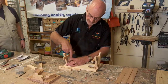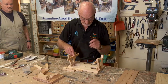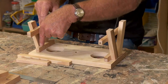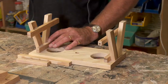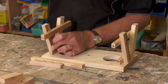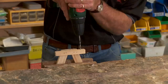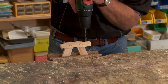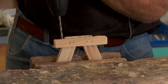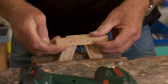One might say, how are we going to get in there to attach that, because we want to go through in this direction — not the other direction — so that we don't have screws and things showing through the top. What we're going to do is drill a couple of holes through here on a slight angle, so that when the time comes I can run a screw down through there with my long-handle screwdriver. So I'm going to drill these at a slight angle, not too much. We'll do that with the second pair as well.